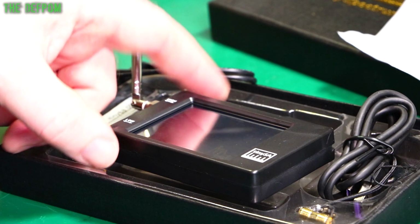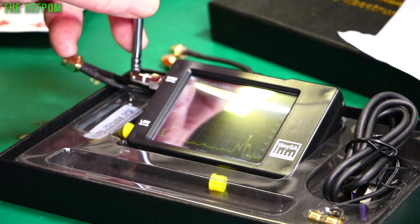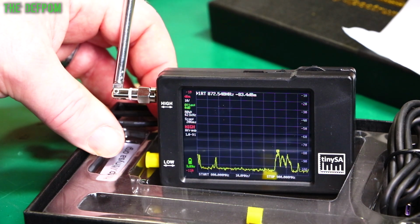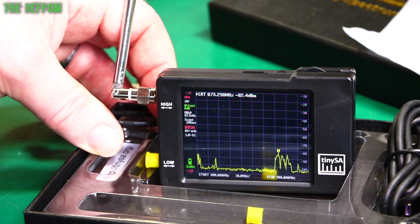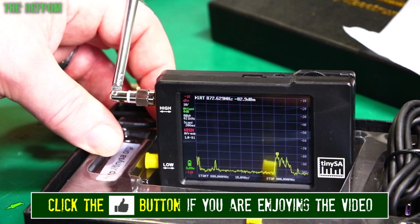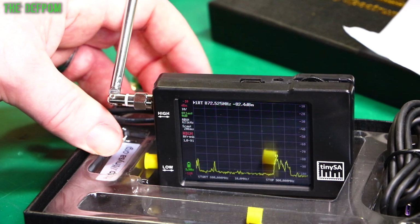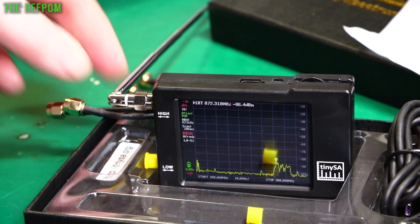So it's getting a whole lot of noise, as you can see there. So it's found a whole bunch of noise. Nothing like trying to get reflected screens on camera. So there's a whole bunch of stuff around 900 megahertz right now, which is curious because I don't actually know what's supposed to be there. There's nothing there. Well, that particular band looks like the 868 megahertz band actually, but there's nothing in this area, so I'm surprised about those frequencies being so prevalent. Curious.